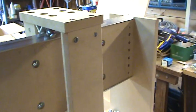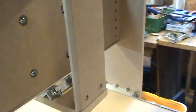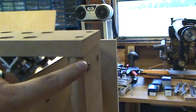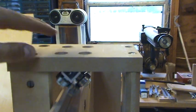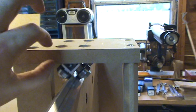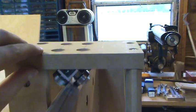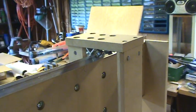So here's what we're going to do to fix that. We have to take this apart to do some more drilling and assembly, but when we put it back together, we're going to tighten up down here and back here. Then in the gap up in here, we're going to put a flat washer and then put this top on and screw it down. That washer is going to lift this up just the thickness of the washer, and take a little pressure off of these bearings, so it should loosen up this just a little bit. This is something you may or may not have to do on your design.